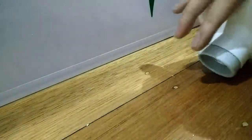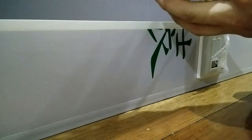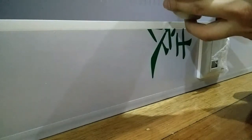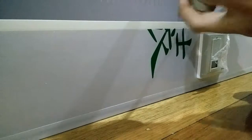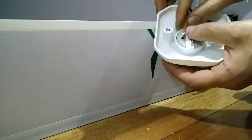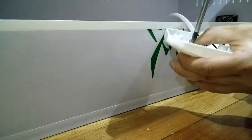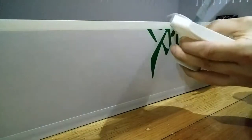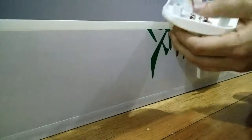So with the underside of this, what we do is, hopefully this can fit. Let's see if we can film it this way. See the lip here? That's the lip. As it raises up, there we go, that's better. Feed any of the red or black into these two ports, like so. A bit tricky. Open this up. And that's it. Just push it in and tighten up. As long as it bites into it, don't over tighten it so you actually crush and break the cables. As long as it's tight, that's good. Because there'd be nothing else pulling on it.